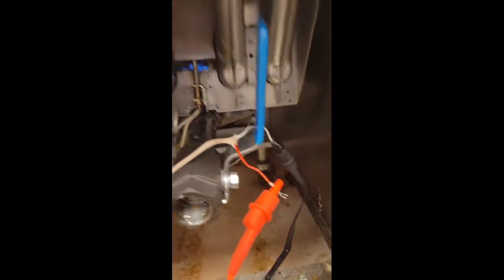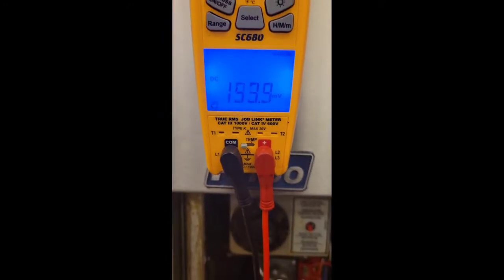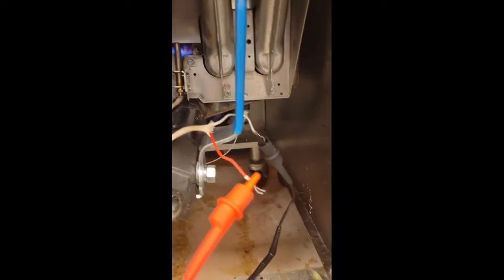You see it is about 120 millivolts and climbing rapidly. I like to see around 750 millivolts total with no load.